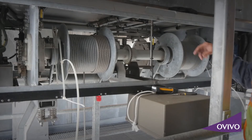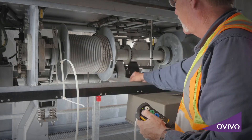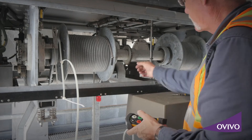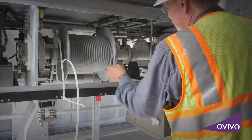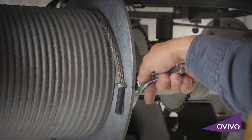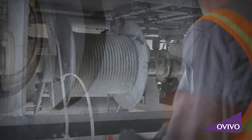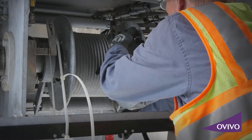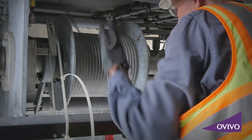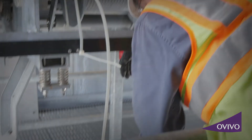I backed it off the lower limit by removing the chain, so it should continue to go down. I'm still feeding it off — you can see it's starting to come down in width. Right there — I have no more wraps on here. I take my crescent wrench and loosen up the clamp. I put my gloves back on, pull it loose while still holding the cable on the other side, and then drop it to the ground.